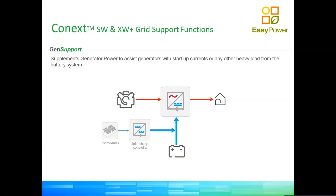with the peak loads. That's very clear because the generator likes to run at high loading, 70-80%, for fuel consumption. So in order to use a generator whose base load is very close to its prime power setting, we use this kind of setup where the peaks are supplied by the inverters. In that case, we can have the best of both worlds. We can have a little bit of backup by means of battery and some PV generation, and we can have a generator that runs 24 hours very close to its peak. So it's a great application for people who are going to have a generator supplying the base load of a microgrid. Okay, and inverters are able to perform that function. That's what we call generator support.